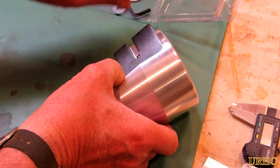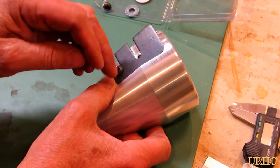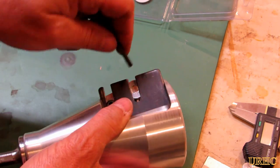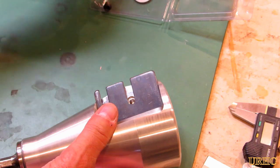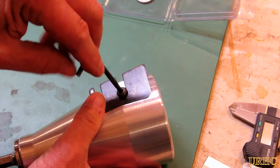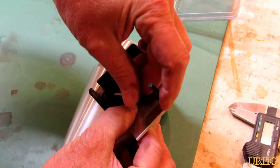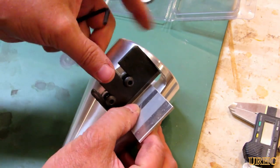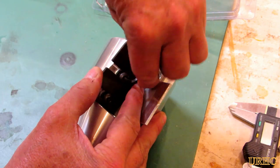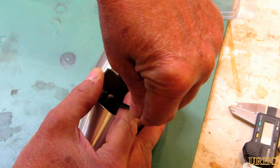Then it was time to put the blades in. It was a little tricky getting the washers under the blades. I started with the thicker washers, lining them up with the threaded hole and getting everything in line before putting the button-head cap screws in place. The machining was really high quality - a really nice looking piece of equipment. I used my gauge to push the blade up against it, keeping everything square while tightening the screws.